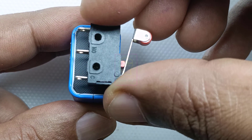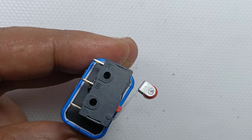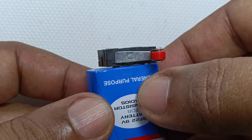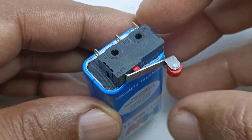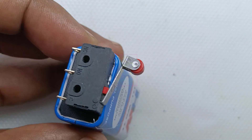That is why we are fixing this using a glue gun. The 9 volt battery will stay for 6 months. This is because when we open the door, then only the buzzer sounds, and all other time the circuit is open — equivalent to switching it off. If we were using a transistor for switching, it would consume a few micro amperes. That is why we avoid that.